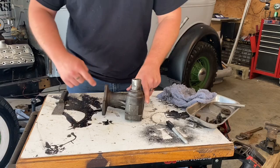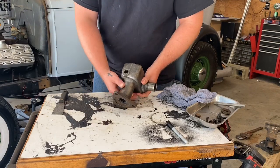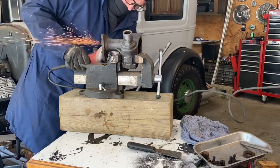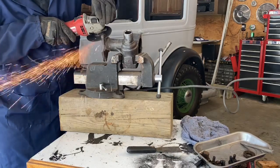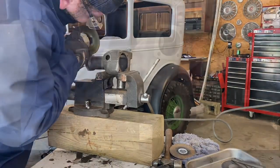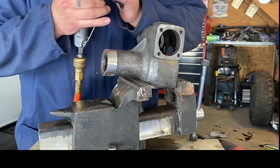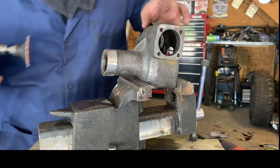What I'm going to do now is put this in a vise and cut this flange off. After I cut the flange off, I'm going to grind it nice and smooth because this whole shaft right here is actually going to go through the frame on the Model A when we're done. Once that's cleaned up I'll DA it and we'll be just about done with this modification.